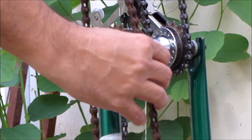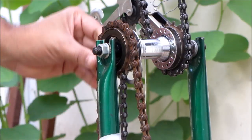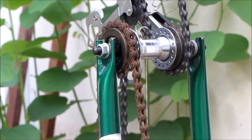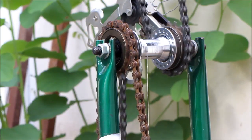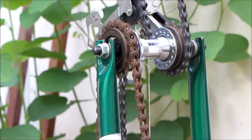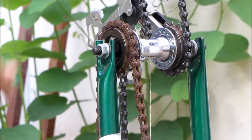When the locking ratchet is armed, the axle can now only rotate in the counterclockwise direction. The lever chain is going up and down. When it goes up, the axle rotates with it, winding up the nylon string, taking the mass up. When the chain goes down, the axle is halted.